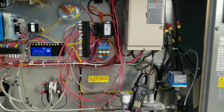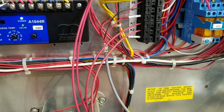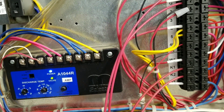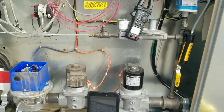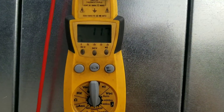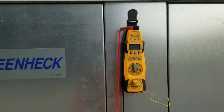Here's where we're at guys. I made a few adjustments — I didn't want this video to go too long. We disconnect terminal number three, which puts me into high fire. I went into high fire. I had to adjust — got my outlet pressure about one inch water column, so not all of my readings are really jiving here. There's our burner in high fire. Doesn't look bad. I'm wondering if maybe I've got some air flow issues. Supply temperature in high fire — it's at 118 right now, but it was running up around 125 to 130.